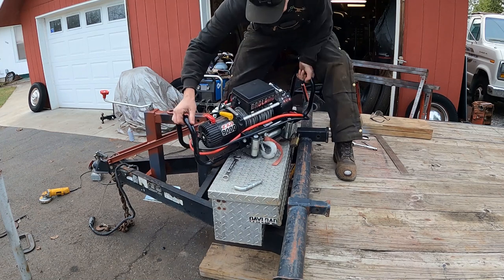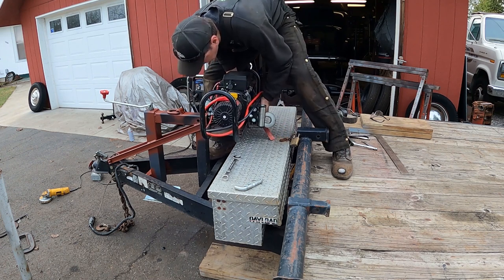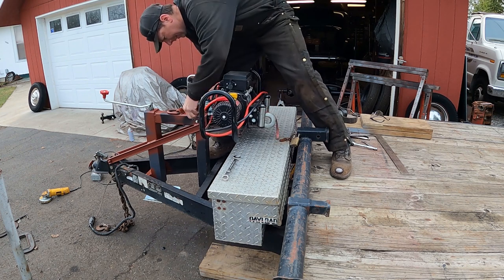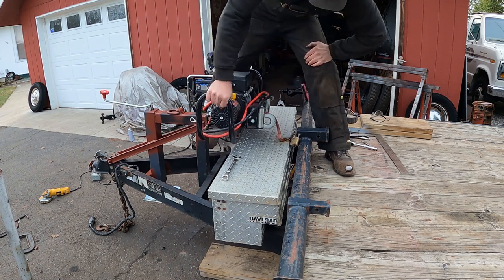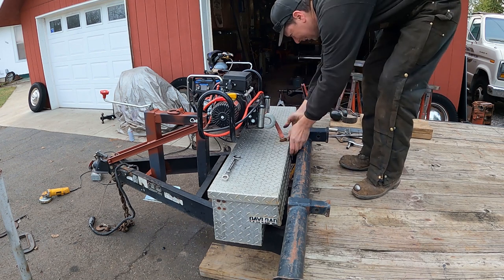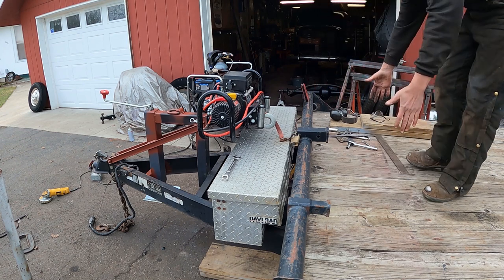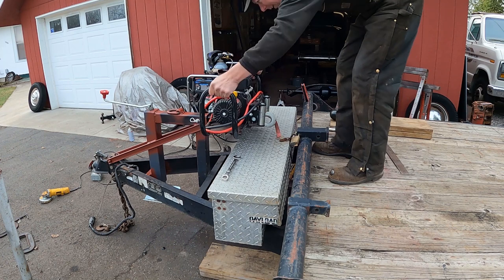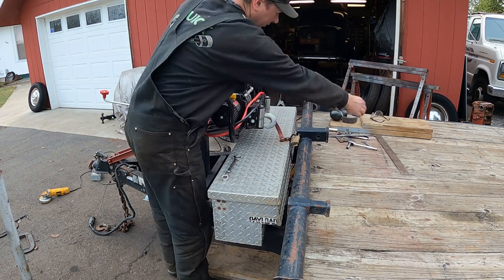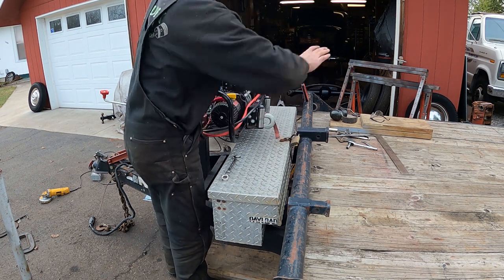Let's get the winch out. Now I can set my battery up and winch right out over the center of the trailer — it's up out of the way. Now I can bring a car all the way up to here, or a big truck, because before the winch would be back here and I'd have to get up and take it out. I can have that ride right like that. When I go to pick stuff up I can just leave it right here and ride up here like this. The roller is fairly down here so I can spool the cable right out over the trailer. I can always cut this off and fix the tube if it's in the way, but it should travel right out and where it's got to go.